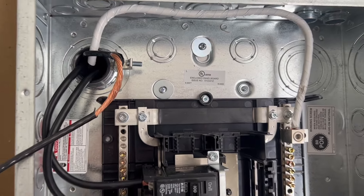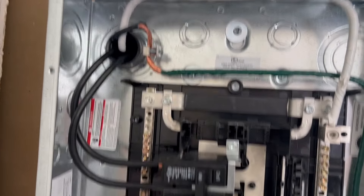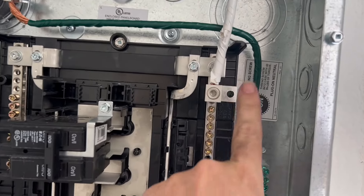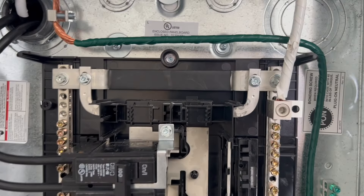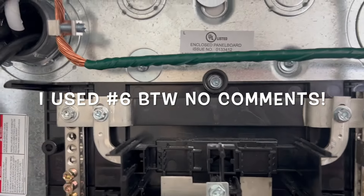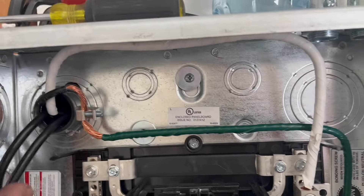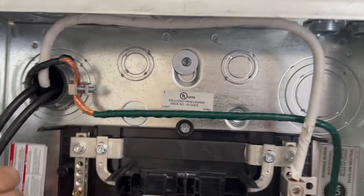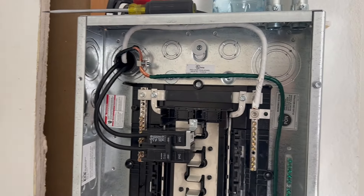Let me give you a glance at what I'm doing here. What we're going to do is take a measurement from inside the connector to inside that LB. There's a lip where the pipe stops, and if you get a lip right inside that LB, I don't have to worry about the connector — I know where it's going. That's going to be the outside of the panel. It's looking like I've got nine and a half inches, and that's going to be my nipple to get us right to the back of the panel. Then we're going to surface mount this.